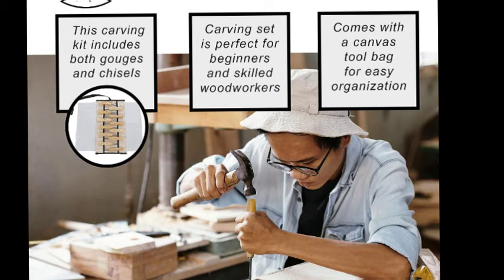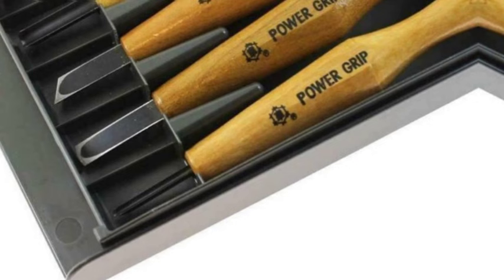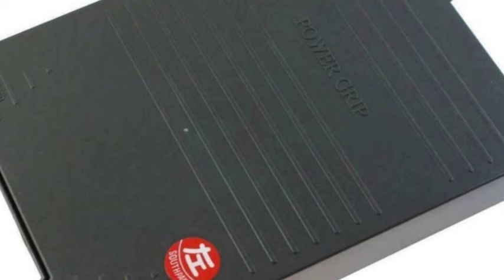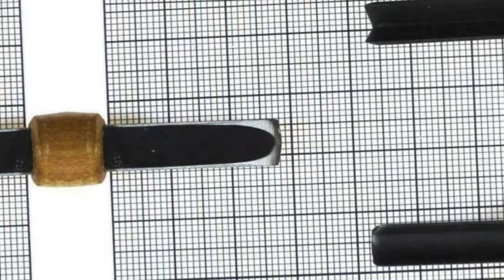Number 4 on the list is Makisio Wood Carving Tools. Make excellent wood carvings with Makisio's excellent set of 5 southpaw power grip wood carving tools. Each wood carving set comes with a carry case box that securely locks closed and is also a tool stand when opened. These tools are designed for left-handed people or those who prefer the bevel on the opposite side of the blade. The razor-sharp blades are made with laminated steel and heat-treated for maximum sharpness and longevity. The complete length of the tool is close to 14.5 centimeters, with a blade length of 3 centimeters.